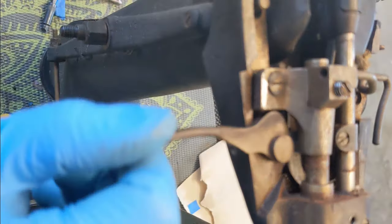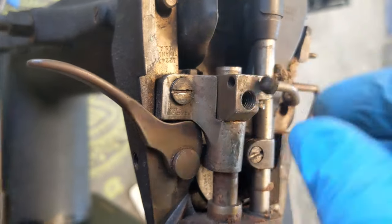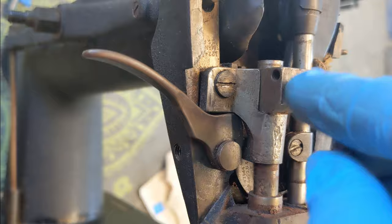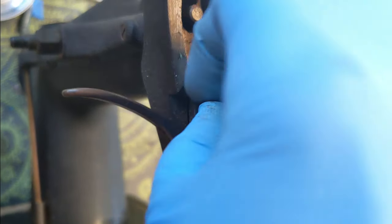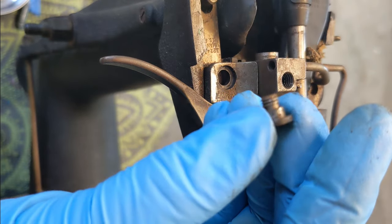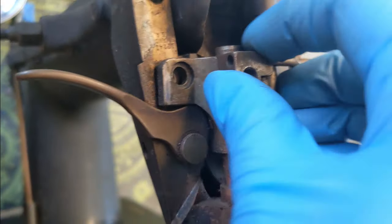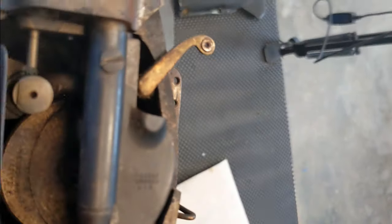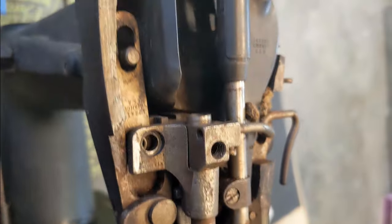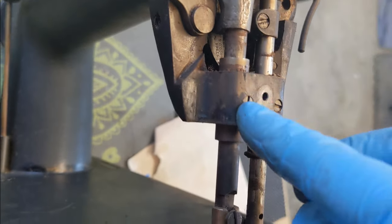It's not coming out yet, so I lifted it — just pushed it up — and now this whole piece slid up, which did not do that before. I've loosened up this little set screw, putting it aside, and loosened up this screw which has a little shoulder on it, a big flat head. It was right here. And I'm going to see if I can just wiggle this block up. It looks like I should be able to, the way it moved up earlier. But it actually looks like it's attached to this shaft somehow.